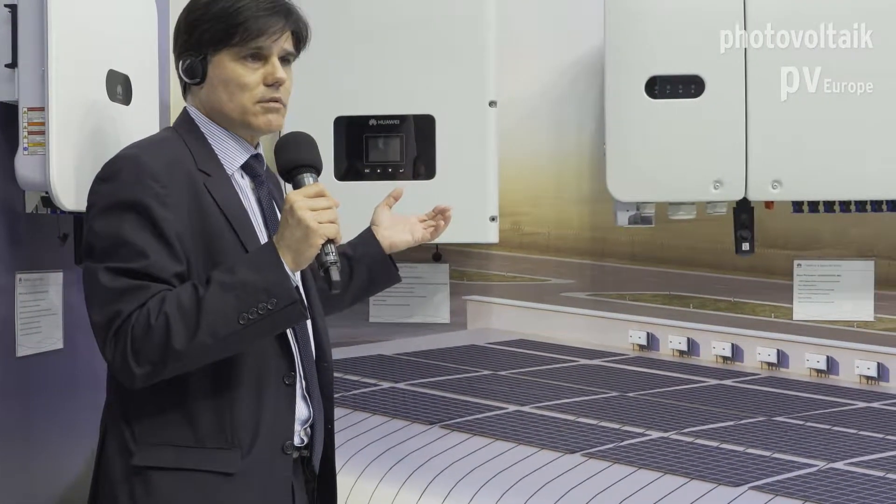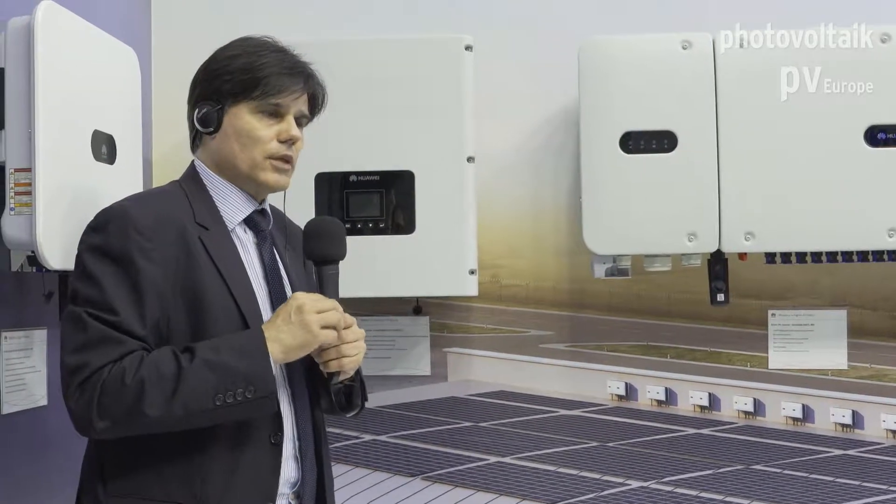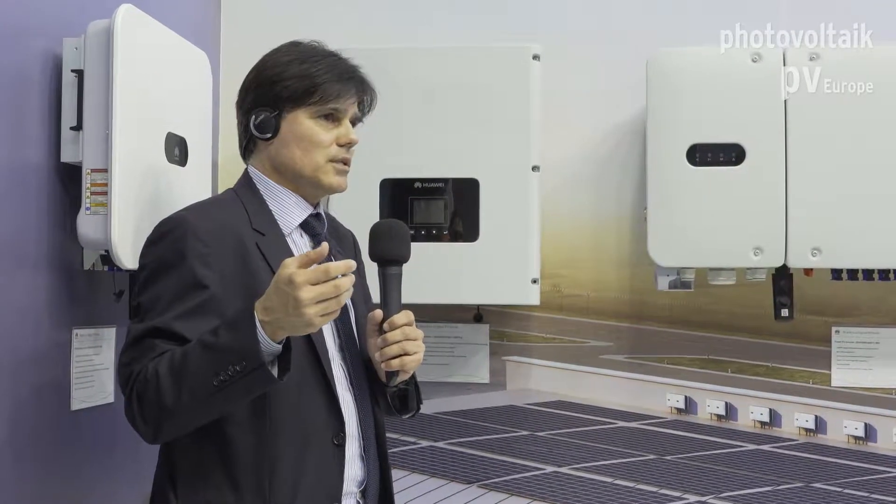One family within Fusion Solar includes devices with a display, covering smaller power ranges: 8, 12, 17, and 20 KTL models. These also have passive ventilation — common across all Huawei inverters. They also support a maximum of two strings per maximum power point tracker, so again no DC fuses are needed. The concern with DC fuses isn't their cost — maybe three to five dollars — but rather that after a few years in warm climates like southern Europe or India, fuses age and start failing.